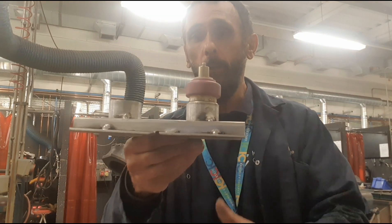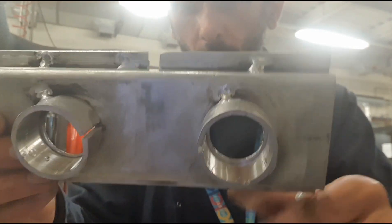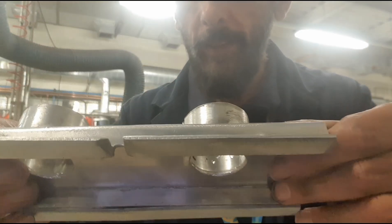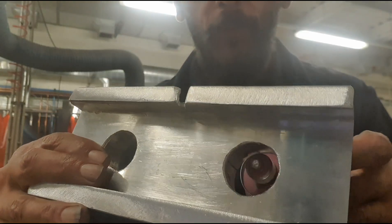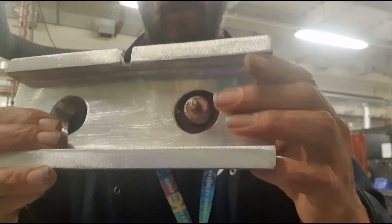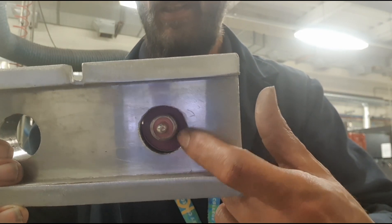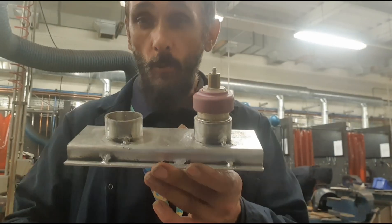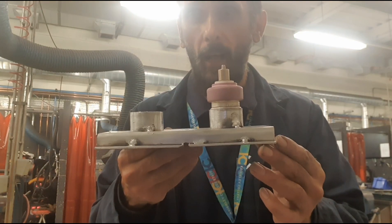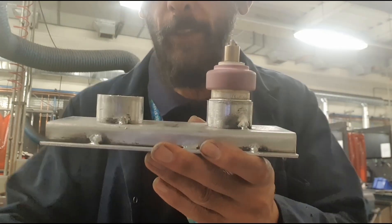So I've got the finished product - looking okay actually. I've managed to mount the valve in it. This is the end result and the valve's a good solid tight fit. This plate is going to go in and sink into the bottom of the amplifier. I've cut slots where the cables are going to come through with the anode and cathode connecting cables, and that'll all connect on the underside of this channel. The valve pops through with a good snug interference fit - perfect. I'll just slide the clamps onto the internal anode connector and cathode. I've still got a little bit of fettling to do - drill four holes so I can mount that, and put another valve in.